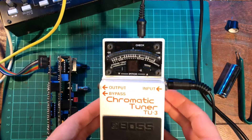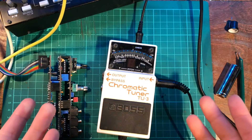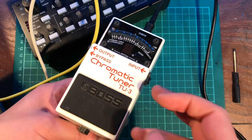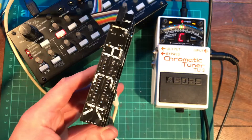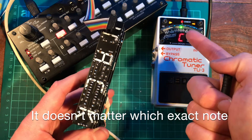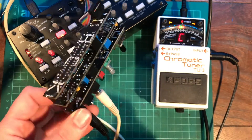So you're pretty much exactly on the octave there. With these tuners, they can make things look a lot worse than they really are, and the ultimate test is just listening to it — see if it sounds fine. If you don't have a guitar tuner like this, you can just use a free phone app. Here we're sending in 0 volts and it's pretty much on C. If you can tune it exactly to the middle position, you can use the frequency pot for that.